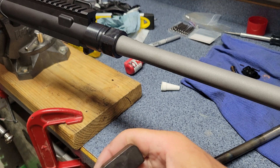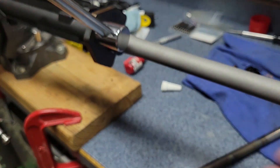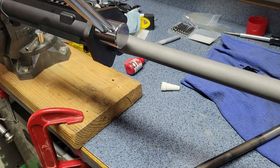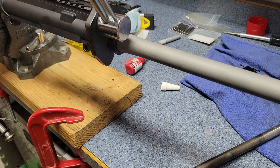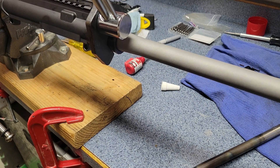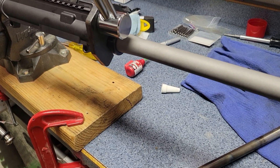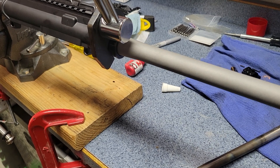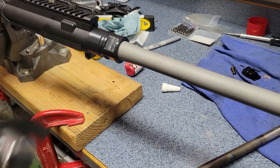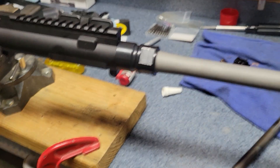Alright, I've done it three times and now I'm going to set it to a final value - probably about 50 foot-pounds. Apparently you can go all the way up to 85 and that's fine, but I don't think I need it quite that tight. There we go, it's about 50-55 somewhere in there. She's good and tight.